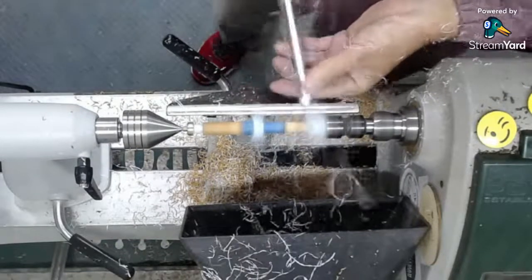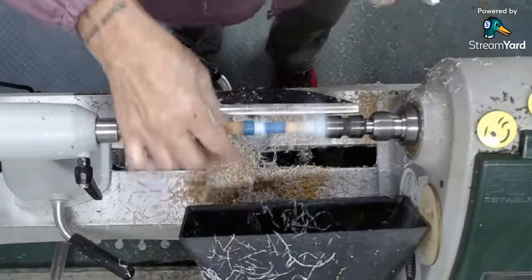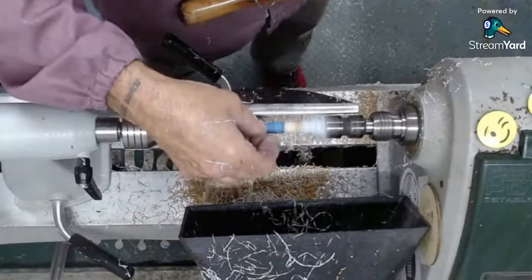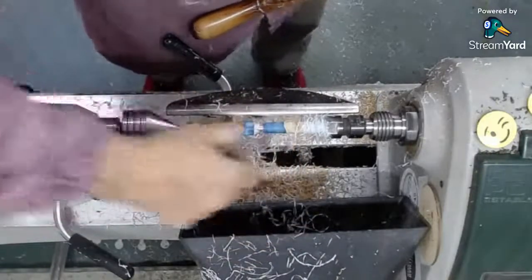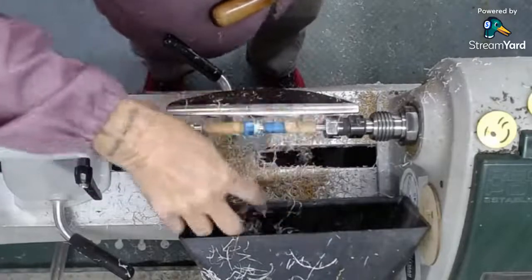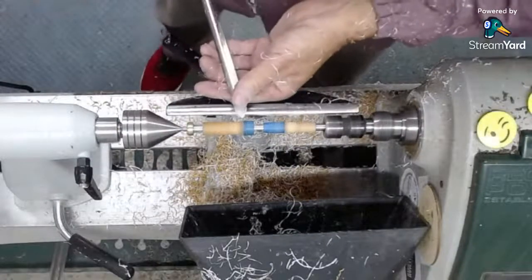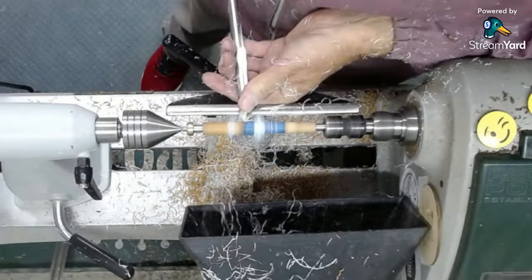Woodwork learners, be careful using extractions as the streams can block the impellers. Yeah, but my extraction is going through a cyclone, so it should just disappear down the cyclone with a bit of luck. And the impellers on my extraction system are protected by a cloth filter, a paper bag, and then an oil filter type thing as well. So there's not much chance of that getting to the impeller. But I understand what you mean.